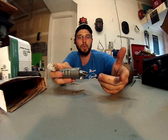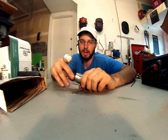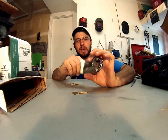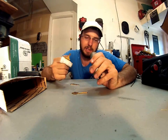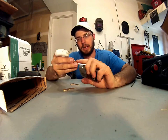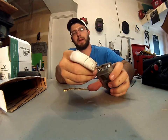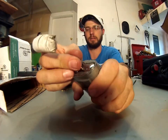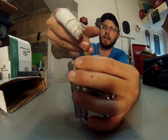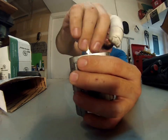It also allows you to put the spool pins in, barrel pins. It does come with two spool pins, but I always like to take it apart, see what's inside, and see if we can't make it a little more tricky — just because that's what I do. You can see the only reason that the backside needs to be cut out on your SC4 keyblank is to allow it to bypass that shroud, that anti-drill shroud right there. You can see how tight that fits. If you did not take that out and they're even, it will go ahead and hang up and hit.